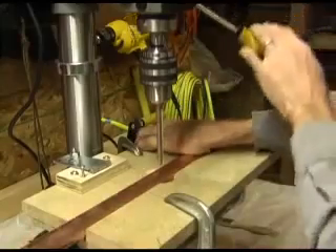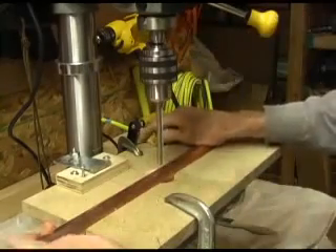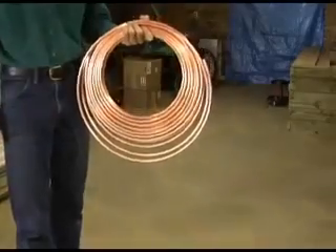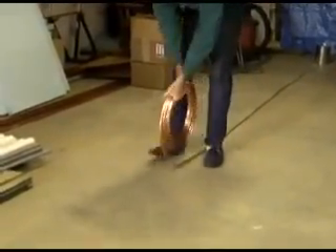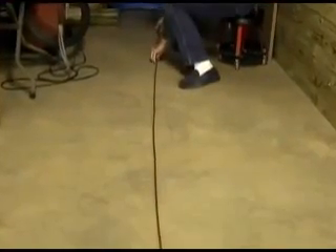Then follow up the pilot hole with a larger bit. My small copper tube has a 3/8-inch outside diameter. The smaller copper tube is 1/4-inch inside diameter. It is carefully unrolled on the floor to prevent kinks. I use 60-foot rolls because it divides perfectly by 90 inches. The larger diameter tool allows the smaller copper tube to be marked and cut at exactly 90-inch pieces.